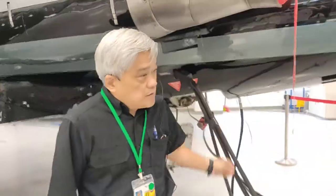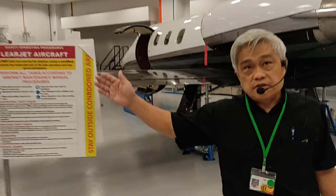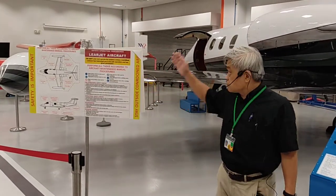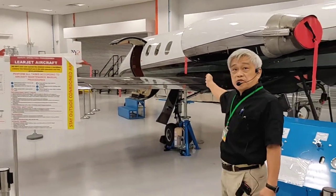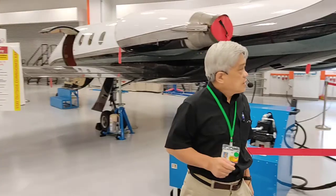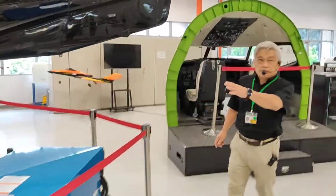Before you start these two, I repeat again — it is very important for the aircraft to be cleared of equipment. The controls in the cockpit must be synchronised with the position of the flight controls and the landing gear, in case someone has moved the controls. Now I will start the electrical and ground power.